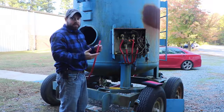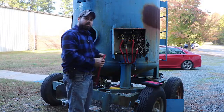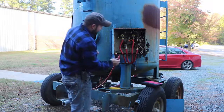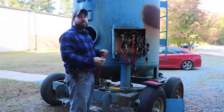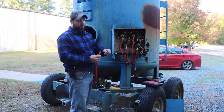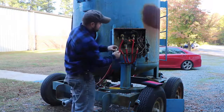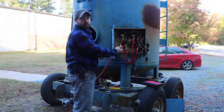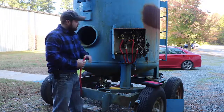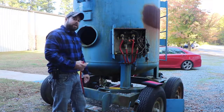Your deadman wire is going to tell these valves on and off, instead of the air going to it stopping and coming back — pretty simple concept. We're going to hook this into our number two solenoid. Same style valve, we've got quarter-inch threading — we'll get that situated with another crimp ring and then it'll come up and go to our number two solenoid. That'll be a project for another day, so for now we're pretty much done with what we had to do today.